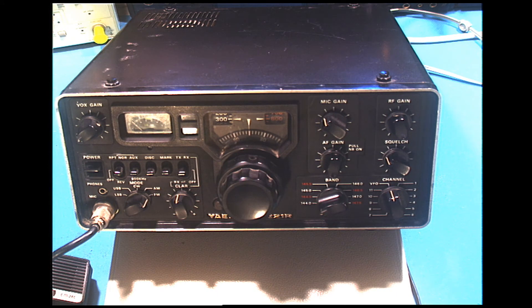The tone adder is essentially a DTMF input. This radio does not do PL tone as we know it today — it has a burst generator you can activate, but it's one to two kilohertz, which is not the sub-audible tone, or PL — what Motorola calls Private Line — that modern repeaters use. There are add-ons available that will add PL capability, and that may be done in the future. All in all, it's a nice little radio and I'm looking forward to getting it working and on the air.